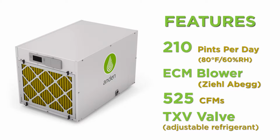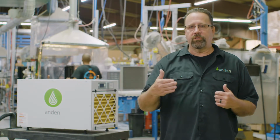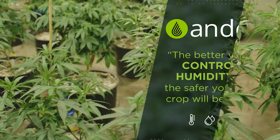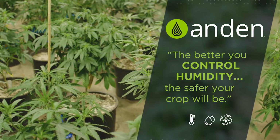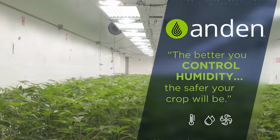We also use a TXV in this model. The TXV gives us the benefit of having adjustable flow of refrigerant into the unit. So a lot of units use a capillary tube, which gives us a constant flow. It doesn't adjust as temperature and humidities adjust. The TXV will adjust the amount of refrigerant into the unit as the temperatures go up and down. Cooler air with less humidity needs less refrigerant, and hotter air with more humidity needs more refrigerant, and this will automatically adjust that refrigerant flow based on those conditions.